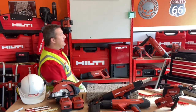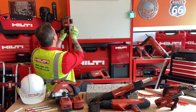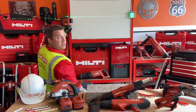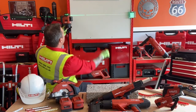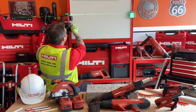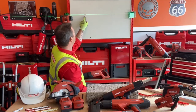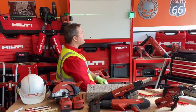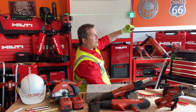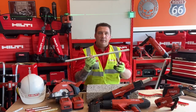On the side there's a very simple fine adjustment — you simply move it up to the pre-marked height of your grid ceiling, secure it in place, and being a self-leveling laser it will level out exactly across that line. If you're having trouble seeing it, you can use a target plate which will illuminate it around that 40-meter mark. Now we need to look at attaching the actual trim to the wall.